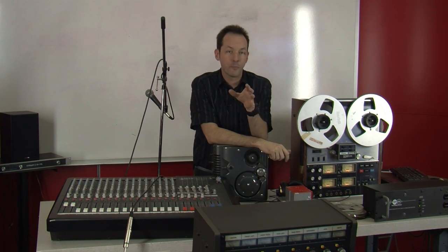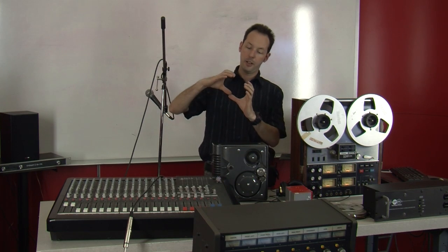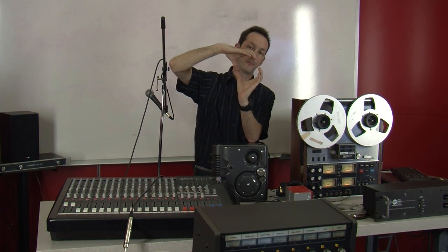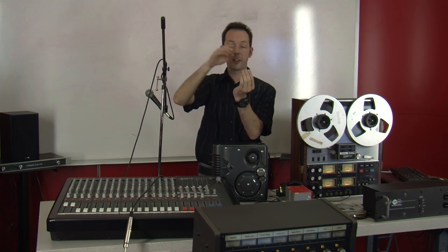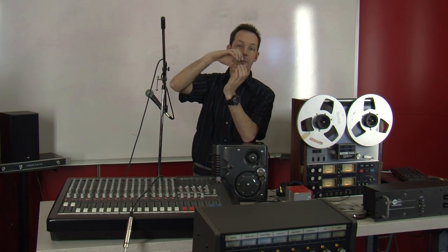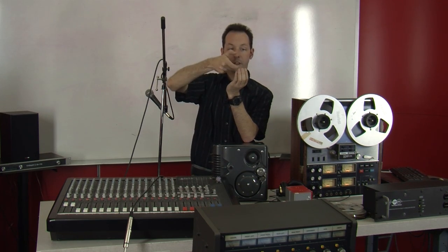When they first started out, they used wire, and they had a magnet shaped like a C, and the wire went through the magnet, and it polarized the wire vertically, like we now use for perpendicular data storage, same kind of concept. It was recorded up and down in the wire. The wire went by and recorded it in slices, which worked really well. The problem was, as the wire goes by, you get north, south, north, south, in varying degrees in between.